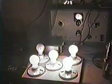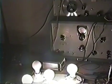As we said, the closest nomenclature for this device is a solid state vacuum triode. Nature itself is providing the river of current that's flowing from a special cathode to a special plate. And we are only putting in a very small control or gating signal to the grid to gate all the other power that you see being consumed right here.